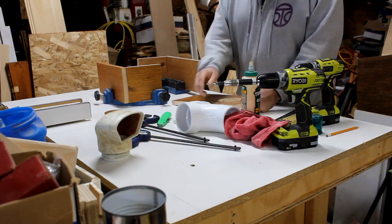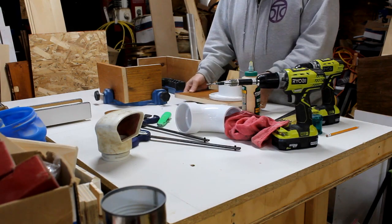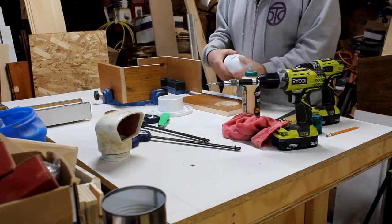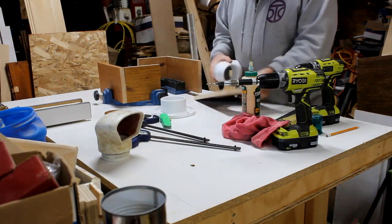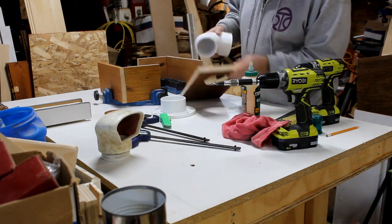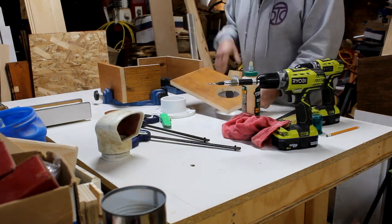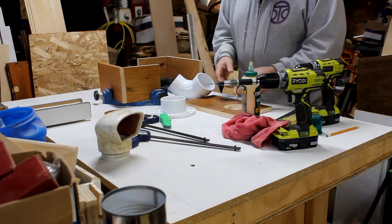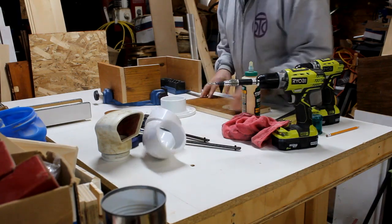Reason for that hole, this flange is going to mount on top. I normally have a nice clean hole for the air to flow, but I have a piece of straight pipe that goes from this flange. It'll extend just a few inches down into the box because there'll be another one that extends up from the deck that the box goes over, and there'll be a baffle in between so that water doesn't get to go inside the boat. All there is to that.